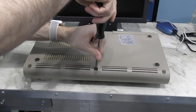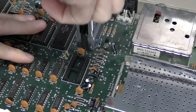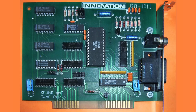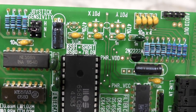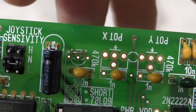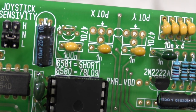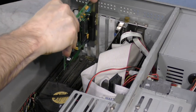However, there are still a few I can show you. But first I'll need to borrow the SID chip from my Commodore 64 — I'll just pull this out and stick it right down in there. I also wanted to mention the original card could only support the 6581, but this replica card can also support the later 8580 SID chip, which runs at a different voltage and sounds somewhat different. There is a little jumper wire visible — to use the later chip you would need to cut that and replace it with a transistor and some other changes. Let's remove the AdLib replica card and replace it with the SSI replica.